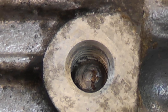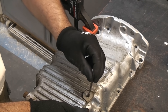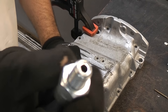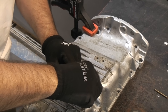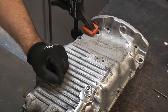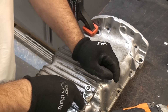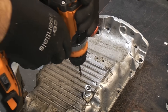With this one you've got absolutely no chance of starting the drill bit on it because it's not flat at all — the chances are you'd skid off and damage the threads. So I'm going to give that a spray, then take the socket head bolt with the hole drilled through the centre and screw that in until it touches the broken bolt, run the nut down and nip it up. I'm going to use a cobalt drill bit for drilling the bolt because these are very tough. We don't want to go too deep and drill into the aluminium, so I'll apply some cutting paste and proceed to drill the hole.